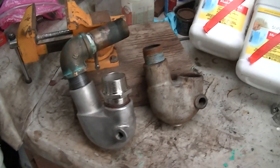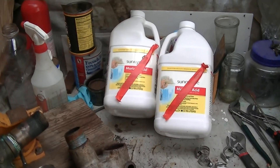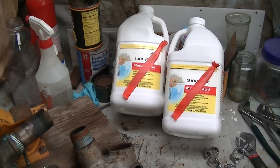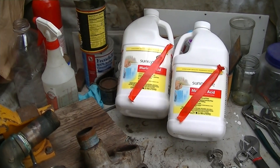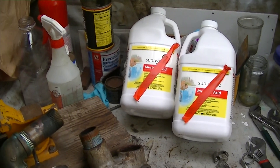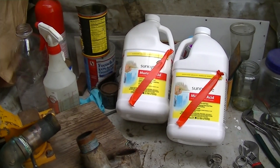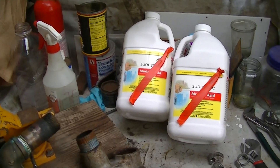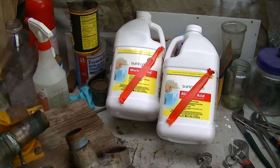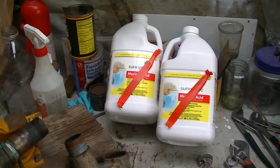In that same video number 75 — this will replace the old number 75 — I said I was going to use muriatic acid to etch my cooling system diluted, and I'm not going to do that. I'm going to buy phosphoric acid. Either I'll buy the trade name Barnacle Buster or I'll get a Jasko product or Quick Clean from Home Depot and dilute it down. If you buy Barnacle Buster, do not believe their claims — the stuff is not environmentally friendly and it is not biodegradable.